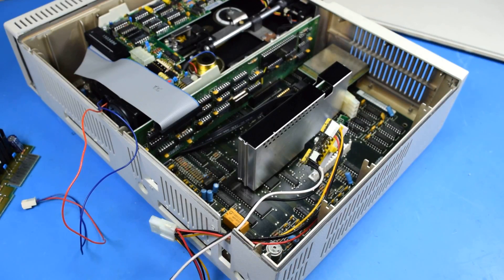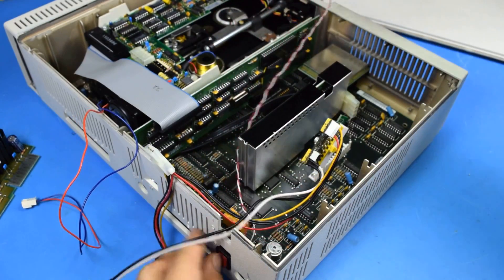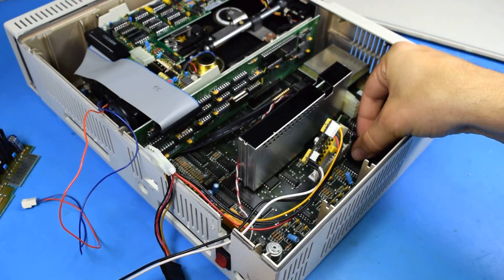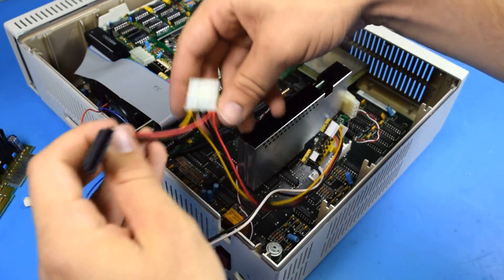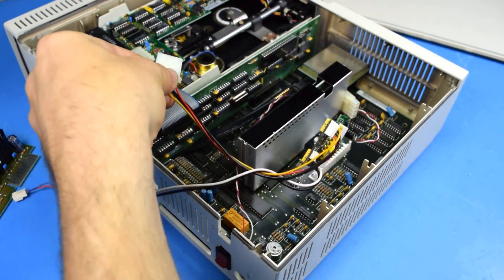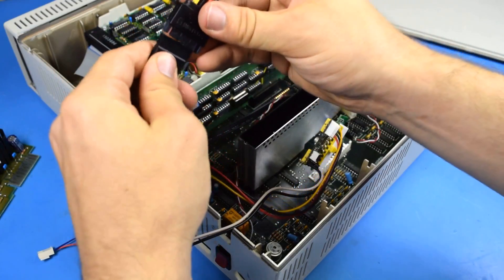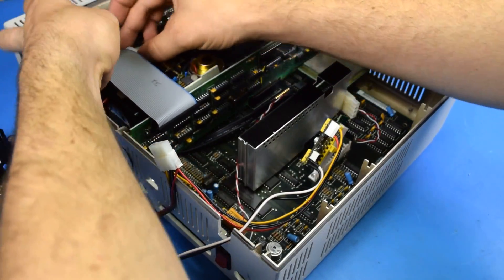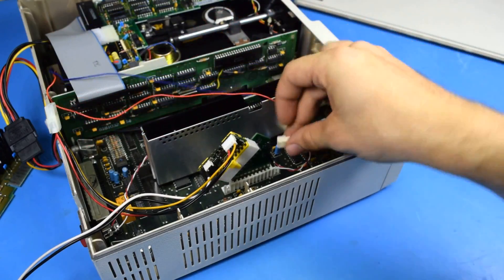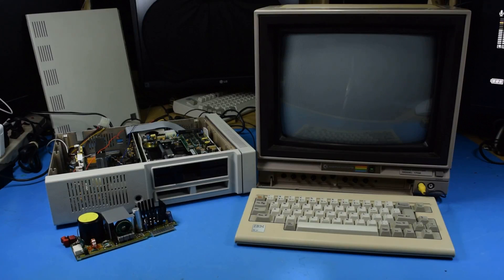I was kind of planning on redesigning the board anyway, but I'll talk about that later. For now I still need to test this. I've got my power switch wired up, so let's feed it in there and plug it in — either way doesn't really matter, it just pulls the signal low. The Molex 4-pin connector off of that doesn't reach, so I'm going to use a SATA-to-Molex adapter, and that will reach just fine. Since I can't close the case anyway there's no point routing this nicely. Finally, I'll plug the fan in down here. I'm ready to try firing it up.